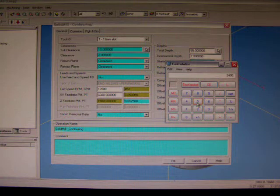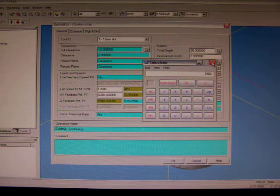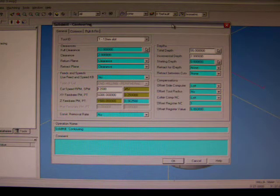Now that would be the ideal feed rate if we were doing, let's say, a 12mm depth of cut, but we're not, we're doing 2, so we're going to ramp that right up. That's why we're at 6,000 millimeters a minute for this operation. But as I say, this is only suitable for doing a light cut. If we were doing a heavy cut, we would significantly reduce that.